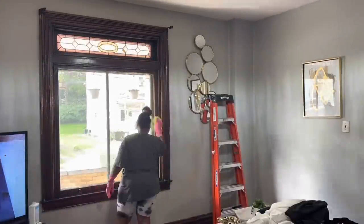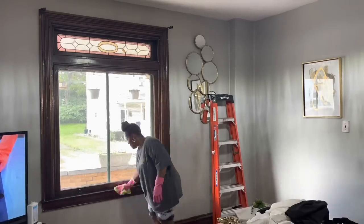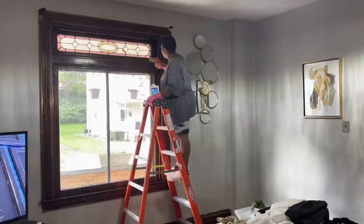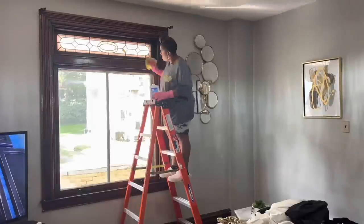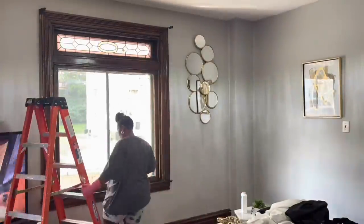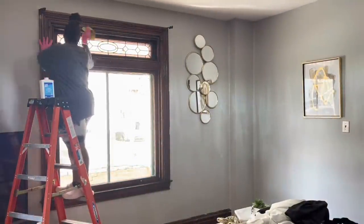So what I'm doing right now is using liquid sandpaper, and I'm going to show you all of the products that I use in the next video. I'm using liquid sandpaper on the wood trim, or on all of the wood. This is another way, instead of sanding everything down. The liquid sandpaper takes that high sheen off, it dulls it out, and it makes the paint stick to it.